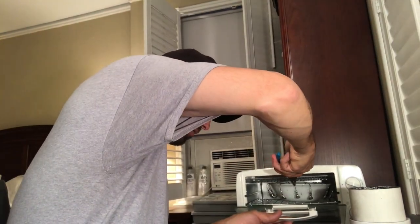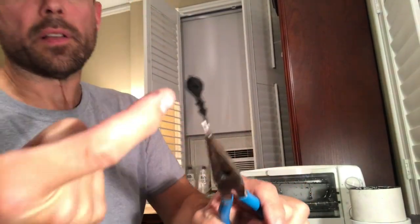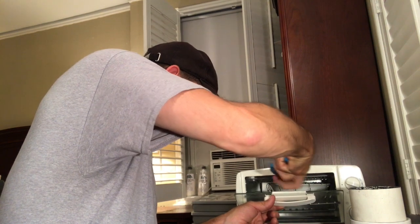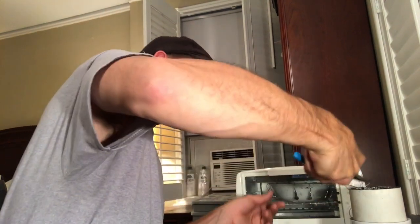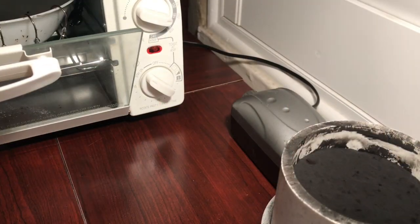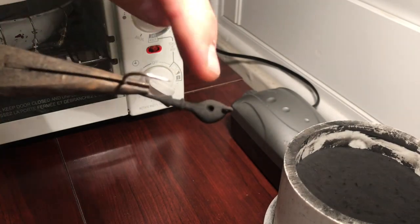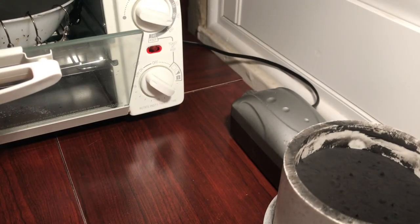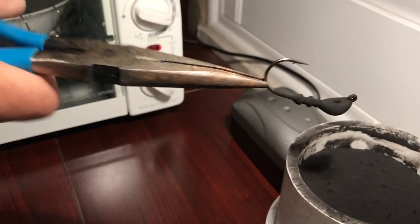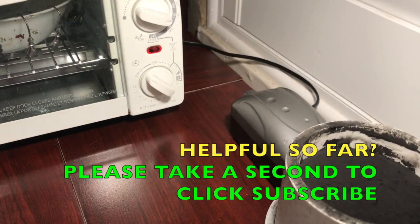Okay, so when you dip it in, just do it really quickly, tap it off on the side so the powder falls out of the cavity for the weed guard, and then just hang it right back on the side of the bowl. Grab your next one, dip it in, tap it, put it right back, and it goes that quick. Okay, let's grab one out of here, dip it, tap it off, and then the powder has fallen out of the cavity where the weed guard's going to go. That is key. Grab another one, same deal, dip it, tap it off, powder comes out of the head where the weed guard cavity is, and just keep on rolling one after another.